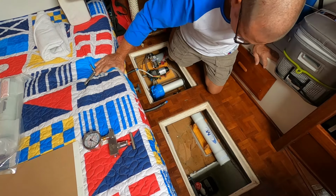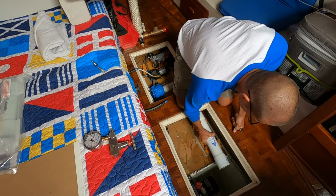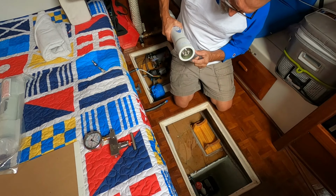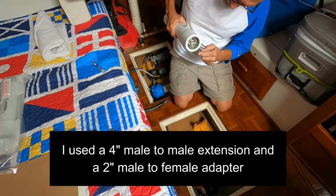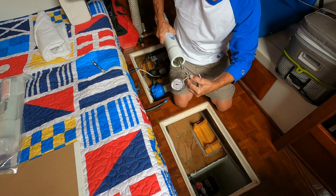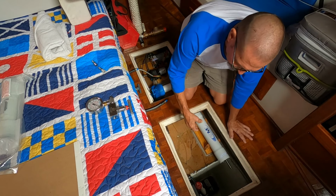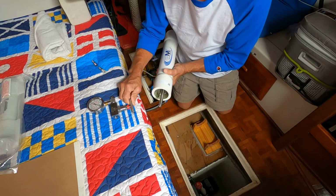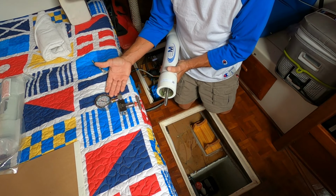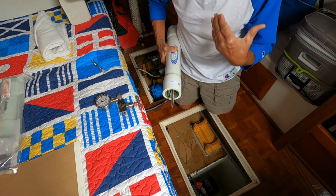Now, once we get into the pressure vessel, you're gonna need a couple more little fittings. The way this vessel is constructed, the outlets are recessed into the end. So you'll need fittings in order to bring your gauge and needle valve outside in order to be able to hook things up. But essentially, as the water comes out, you're gonna throttle it down using the needle valve till you reach 800 PSI, which is the point at which you're making good water.